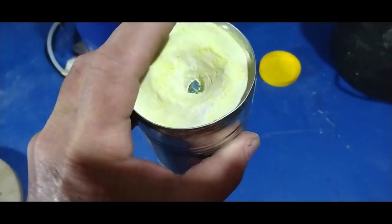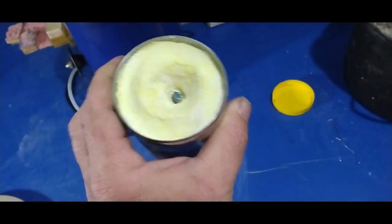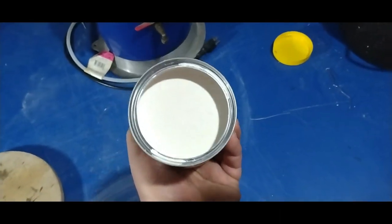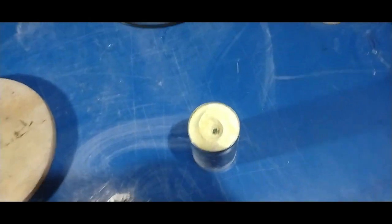I got my mold out and it's pretty dry now. I'm going to let it dry a little bit longer — there it is after I just peeled that clay out of there. You can see there's the sprue right in there. This is the side that's going to go down against the vacuum, and we're going to pour our metal right into here. I got it down in my burnout oven and I'm going to leave it in there for exactly three hours, then I'm going to take it out and cast it.